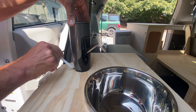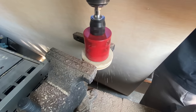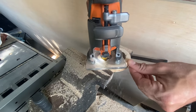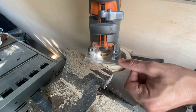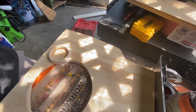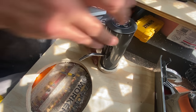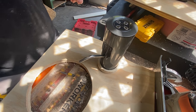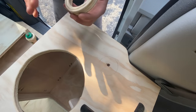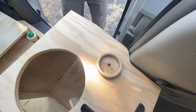Then I moved on to the water pump. I traced exactly where I wanted the pump to go and then moved over to the shop to figure out how I was going to hold the pump in place. I used a hole saw to make a ring that we're going to set the pump in, then used my router to cut a chamfer on the inside of the ring to taper it a little bit so that when we put the pump into the ring we can press it down and it'll hold it nice and tight — no rattling, no worries. I put a nice bead of glue on the underside of that retention ring, smeared it around with my finger, and then made sure it was nice and secure on the countertop using the same fancy clamping system from before.